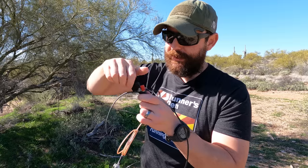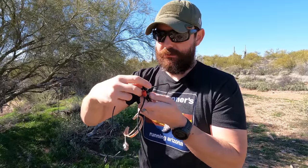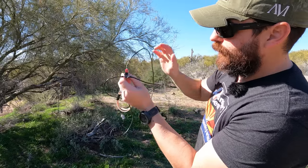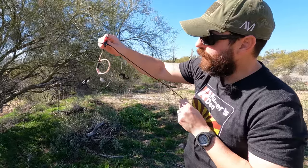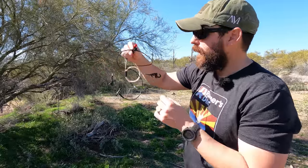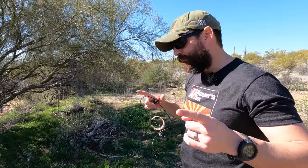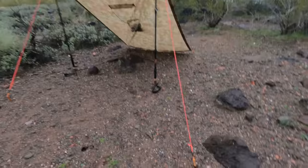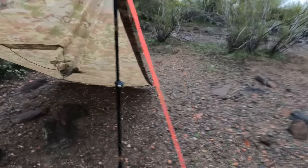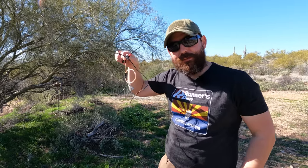We're going to put on our two radials at this angle. We're essentially going to run this from the top of the tree with some cordage, and then these two radials are going to come down at 45 degree angles. At the end I have an insulator — I'm using an S-clip carabiner. Since I carry trekking poles and also guy equipment to establish a lean-to shelter with my poncho, two poles, and the guy line, I also use those guy lines for my antennas. This is what we're looking at to see if we can actually make the contact work.